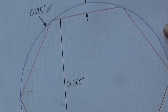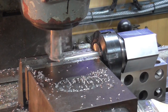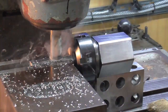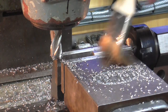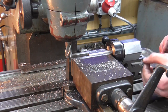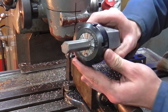Were I taking the hex to a smaller size such that I would have a sharp machined corner, I would actually be gripping on effectively knife edges as I go around. That is the use of a collet block — I would consider a dividing head more accurate personally, but for things like this a collet block is very handy. To check for good alignment I use a 0.001" feeler gauge between the 1-2-3 block and the collet block surface to make sure things are consistent. That has done the job nicely and I now have a hexagon to proceed with.